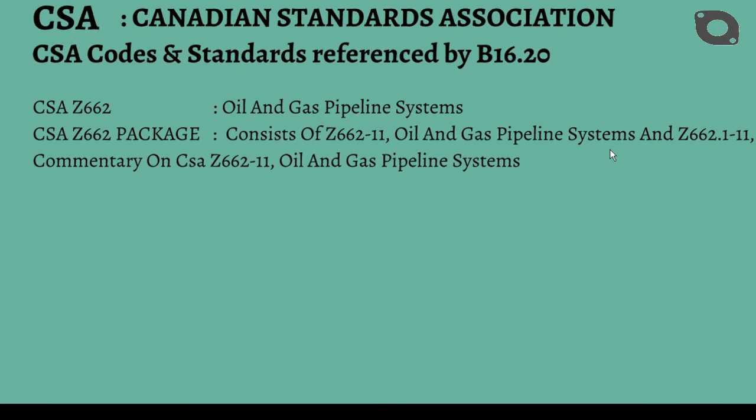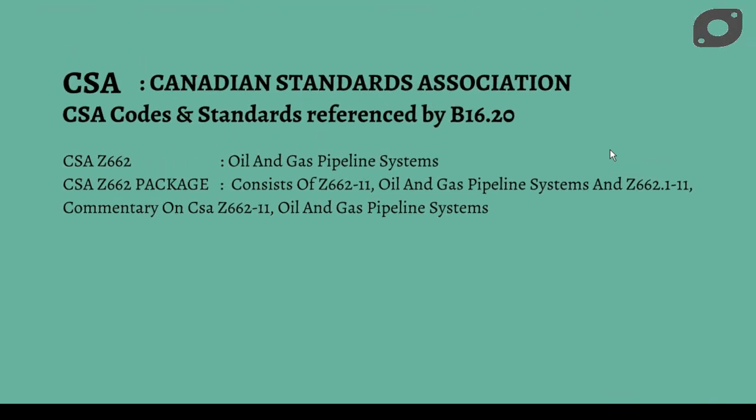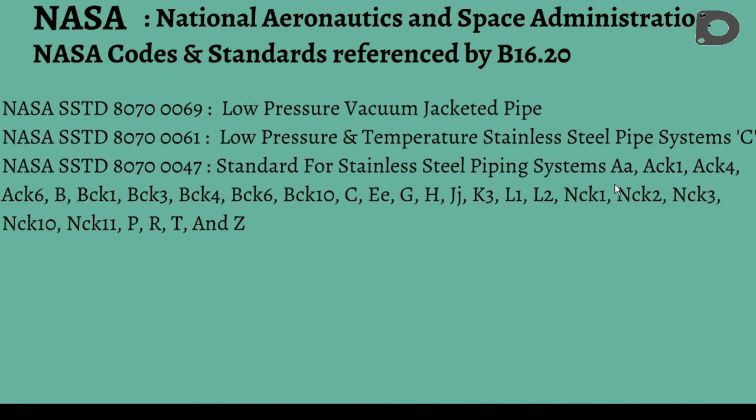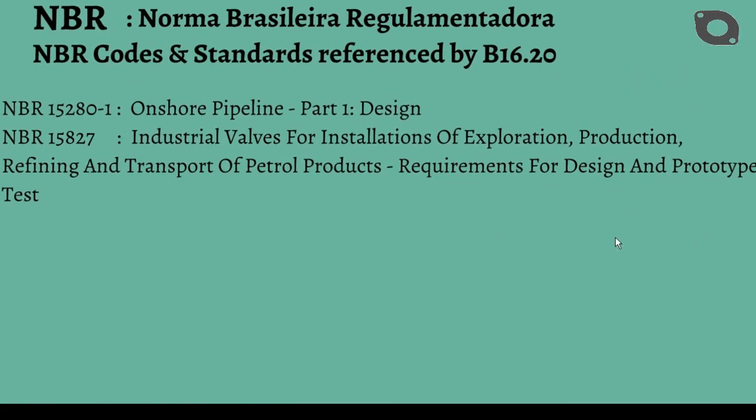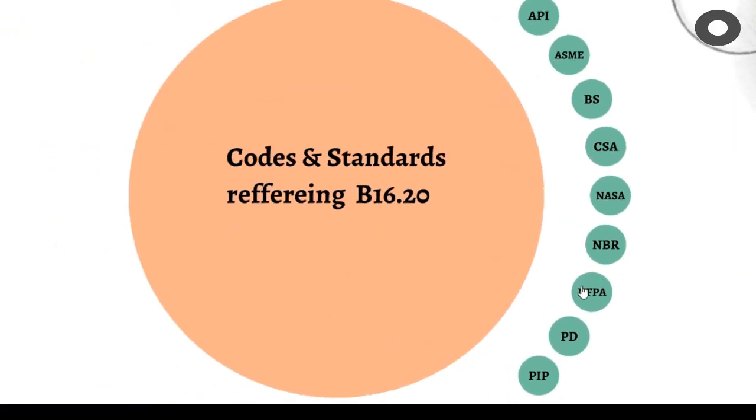Sizing of spiral wound gaskets. Of utmost importance, regardless of the type of flange facings in use, gaskets must be sized to ensure that the sealing element is seated against flat surfaces. If the spiral wound element intrudes into the flange bore, or extends beyond the raised face outside diameter, damage will result to the gasket, and ultimately failure will occur.